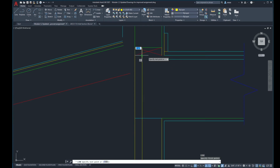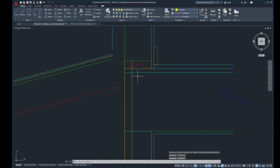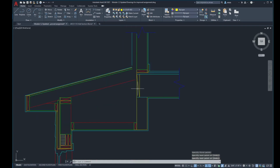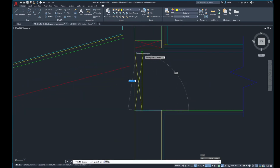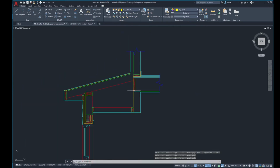Let me get this line at the bottom of our stud wall there. Subfloor comes over to there. Drywall, or sorry, gypsum wallboard goes to our subfloor. Our rim joist goes to here. And there. So here's our joist, here's our rim joist. All of that sits on top of this beam. This video might run a little long because I just want to wrap this up. We're really close to getting finished.